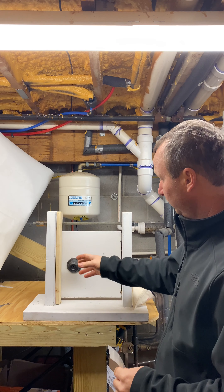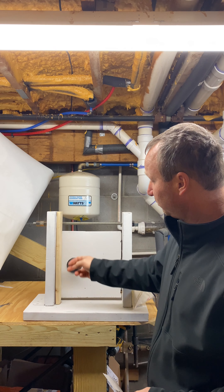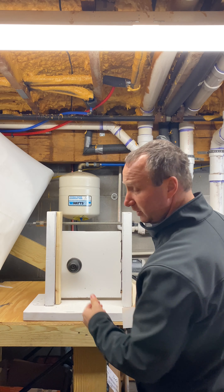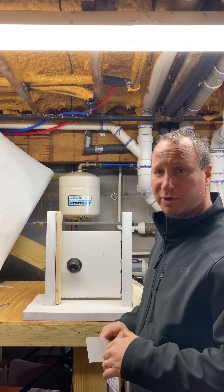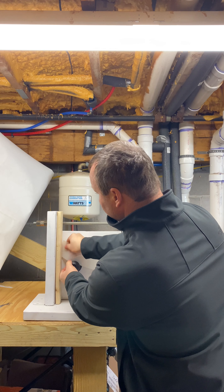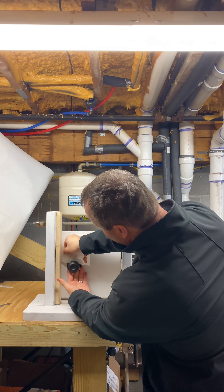So right here we have a door that opens inward. Here's the molding that you would have, and there's weather stripping on the inside. The first thing you want to do is pull the door nice and tight towards you. I'll explain when we're on the other side of the door why you do that. Then you insert the swipe tool right above the lock and push it in.